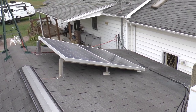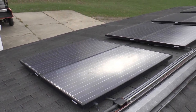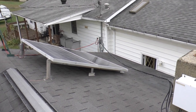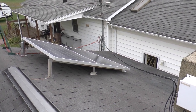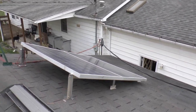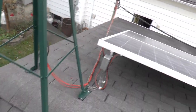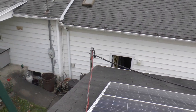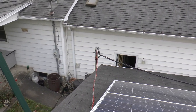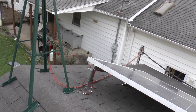I decided to try tilting the solar panels a little bit, because the snow doesn't come off very easily on these. I thought maybe if I tilt them, the snow would go off better. Got them all mounted the other day. Got the wires run right down there at a little weatherhead and into the front corner of the garage, where I'm going to set up a little test area. So now I have a 12-volt system to play with.